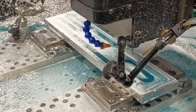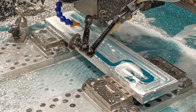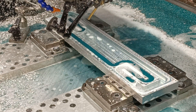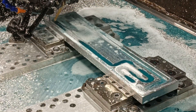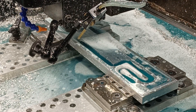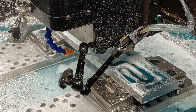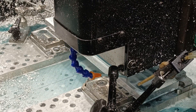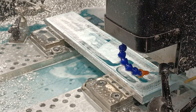A program like this doesn't even really take advantage of the increased cutting speed, but the rapids still cut time. When you're going from one feature to the next and the machine's moving 200 to 300 inches per minute versus 100, that's three times faster. So every time we bore a hole and move to the next one we're saving time. I apologize for the air compressor but I have to let it run because I've got the air blast on.